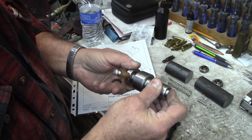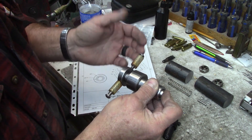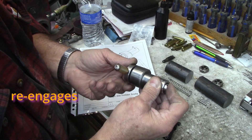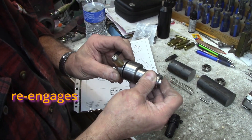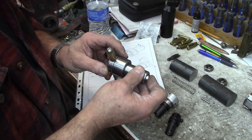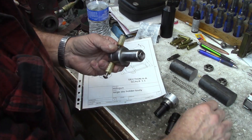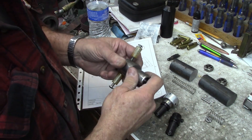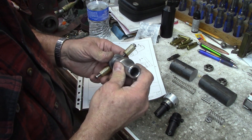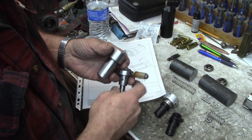When this is all assembled, the assembly is spring-loaded so it will feed in until it releases, then it spins. In my case I have to stop the lathe and back it out manually until the dog releases again, then I can retract it fully. You can do it without the spring and just have it in two pieces, but I'm going to go ahead and take the extra time and do it as one so they don't get lost or separated.